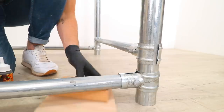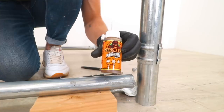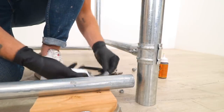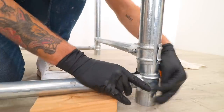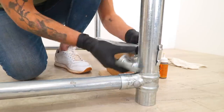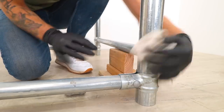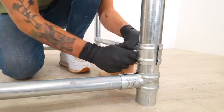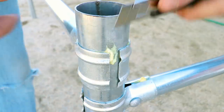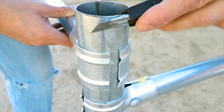One by one I took each joint apart and spread some original Gorilla Glue on each of the fittings. Gorilla Glue expands and is activated by water, so I used a wet rag on each pipe piece to get the curing process started. As I went from joint to joint I made sure each fitting was as tight as possible and kept a framing square to make sure the base didn't get out of alignment. After the adhesive cured overnight I used a box blade to scrape away any excess Gorilla Glue. It cleaned up really nicely.